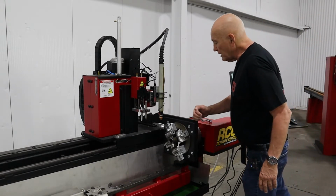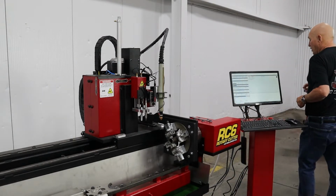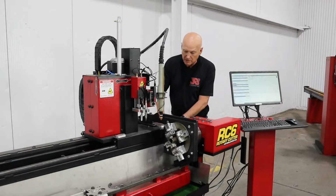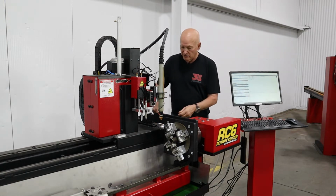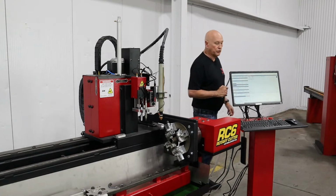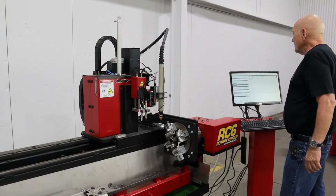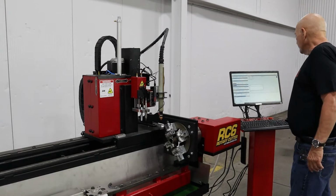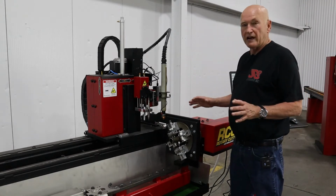Okay, we still can back up a little bit more. I'm going to move that bolt one more position forward so that we have absolutely maximum range of the machine when it comes to the tube itself. Alrighty. Now this time I'm going to use my 19mm wrench. You can also use a 3/4 wrench, and I am going to tighten down the bump stop. Let's go ahead and home the Y-axis again. Once again, yes, I know I have a lifter in the machine. And there we go. We're looking really good right now.